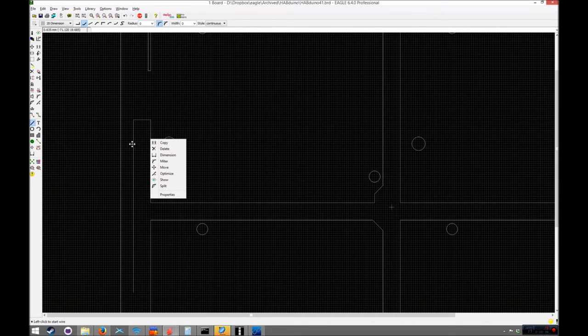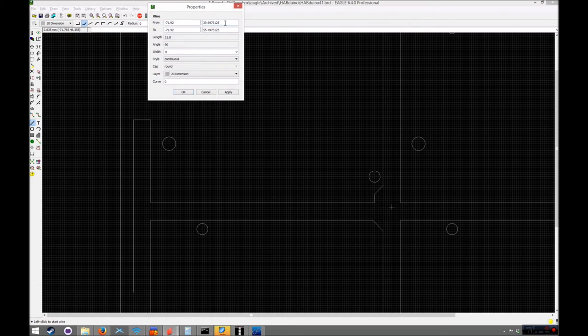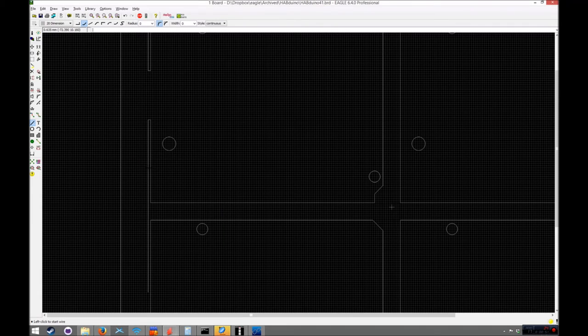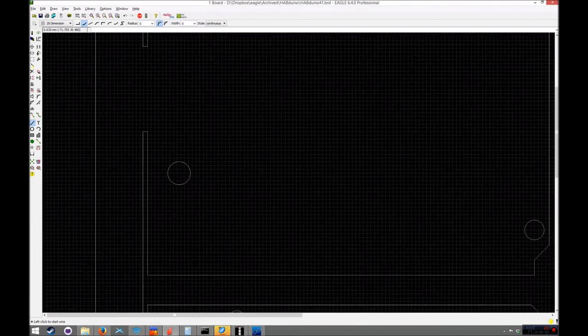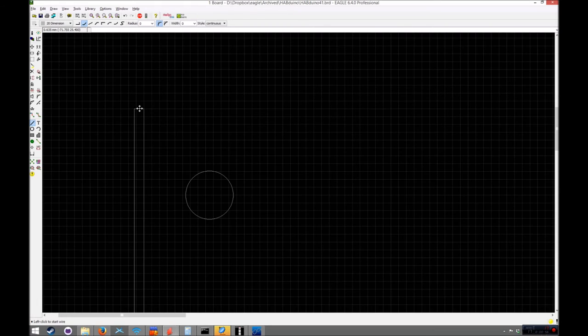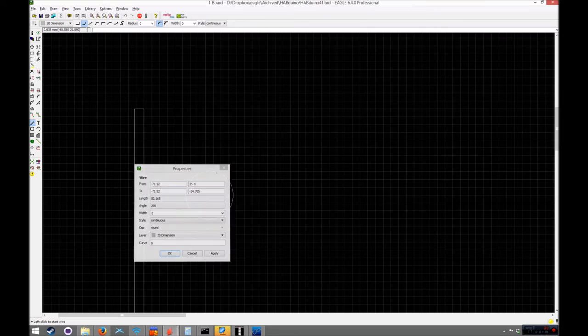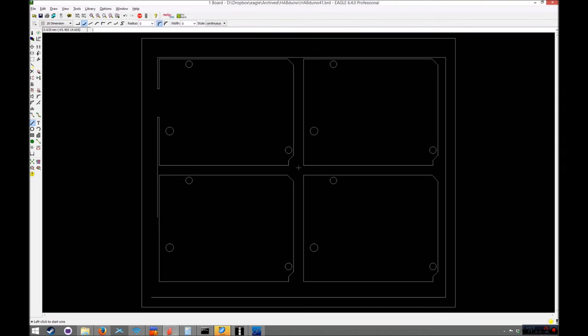and as discussed before, that line there needs 0.8 mil from that line there. However, it should be the same as that, so I should bring that in like that, and that was right, just always worth checking. Point eight should be 7.92. Yep. And again, for consistency, I want that 15 mil from that.